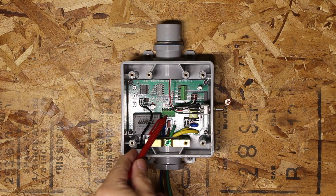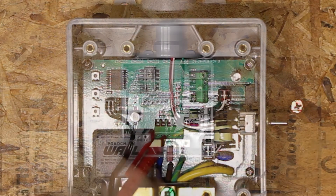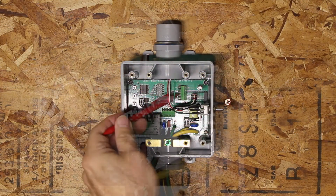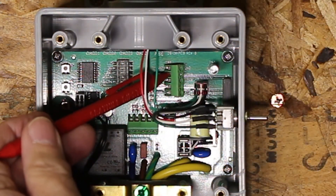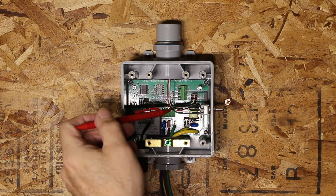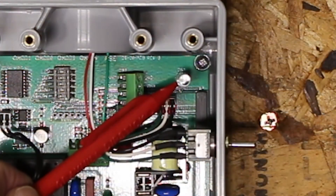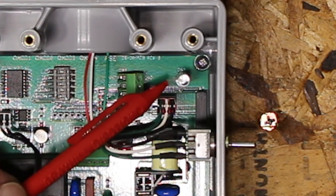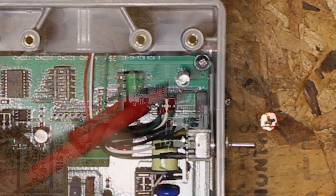This connector is for the attachment of a remote sensor head kit. Do not attempt to make your own kit — we will supply it if you call us. This terminal block header is for the WZ aux controller; this is where the five conductors from that remote control are attached. This is your power-on indicator: when it's on continuously, power has been applied; when it's blinking, the controller is trying to turn on the snow control system.